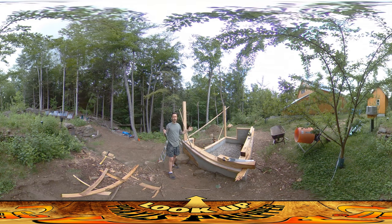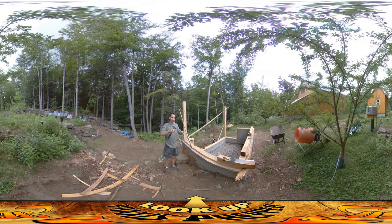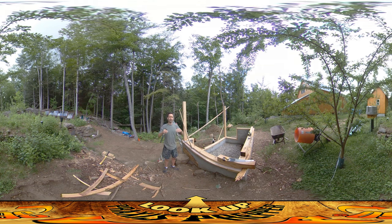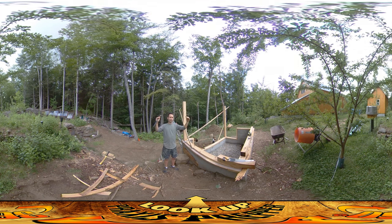I'm going to strike the line from the top of this to the top of that one, right across the tops of all the others, and that's going to make them all perfect. Now, why don't I just cut them all to exactly the same length? Well, when I was working on the foundation, I can't be 100% sure it's perfect — it could be a little higher on one side or have a little bump. Every single chance you get to re-correct and re-level things, it's always a good idea to do so, otherwise you're accumulating errors as you go up. So this is my chance to make the tops of these as level as I possibly can.